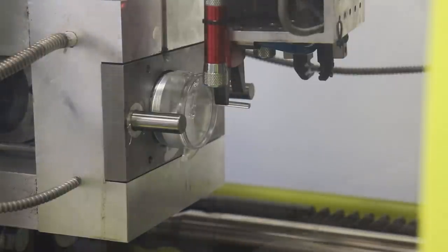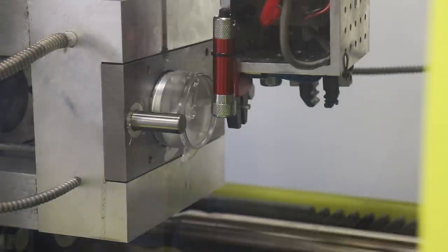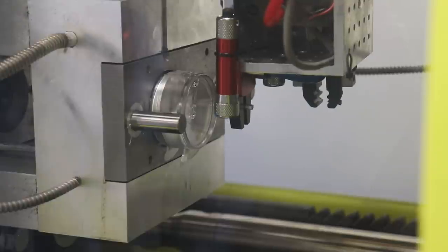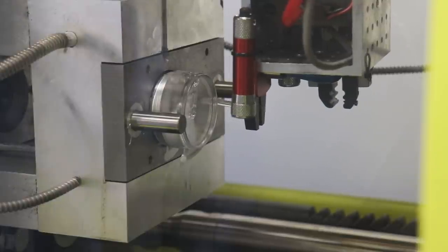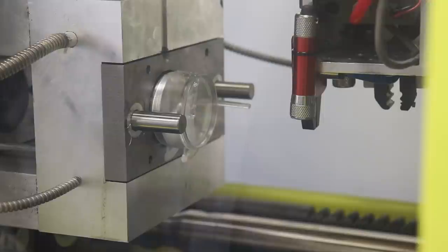All right, now we're gonna go down to the actual pounce. So we come down, we grab. Okay, now I'm gonna move to the line that basically defines the point where we pull the part off of the mold. And I am going to manually move back away from the mold face. And probably do a peeling action too. You know what, I think our part's been sitting on the mold too long, so it's constricted onto the mold.